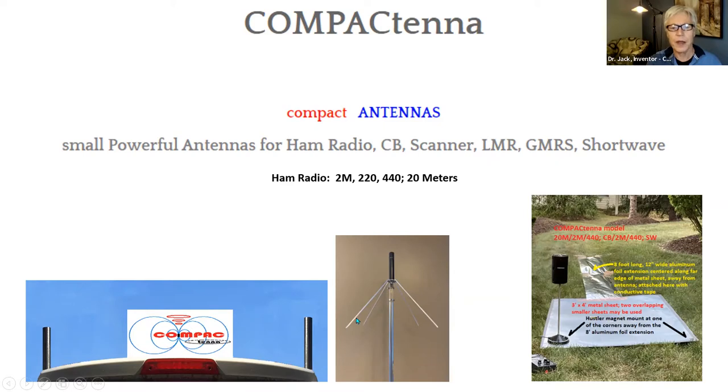The SWR is particularly better at VHF frequencies at the corner. This was getting so much popularity that people were thinking it would be great as a base station antenna. So there are various base station adapter kits out there — radial kits and whatnot — but they're not optimized. So I developed the Compact Counterpoise: an optimized ground plane adapter kit made in the USA, very sturdy, plug and play.